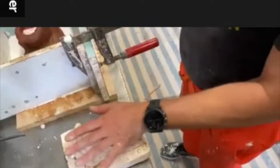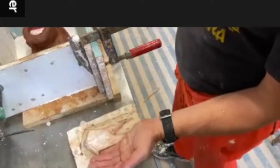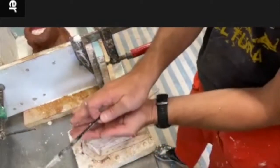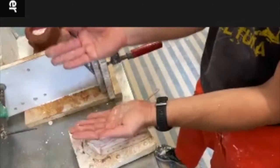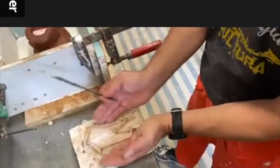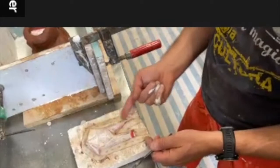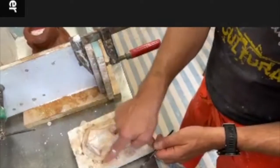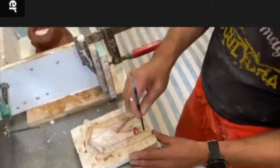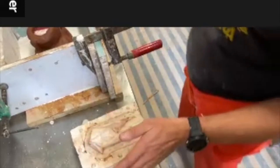So when we have all our plaster molds, we take the plaster mold away and take the clay off, but not underneath, only what is in this part of the plaster mold. So we take the plaster mold off and remove the clay. It's probably sticking in here. We remove all the clay. And underneath, this is still clay. So we make a nice cut along our 3D print. Plaster, clay, 3D print. Then we take the back of a brush or something that is round, and I make little indentations into my clay. And I've done that.